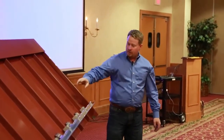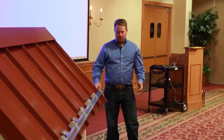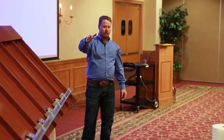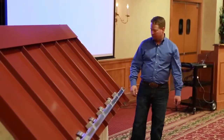In this case, I'm going to skip a seam and install on every other seam. The setup is just like ColorGuard. I'm going to install my first row of clamps at the bottom — they'd be 6 to 12 inches from the eave.